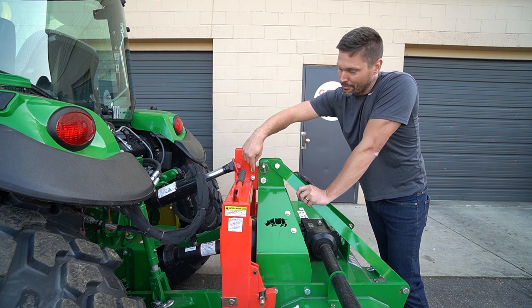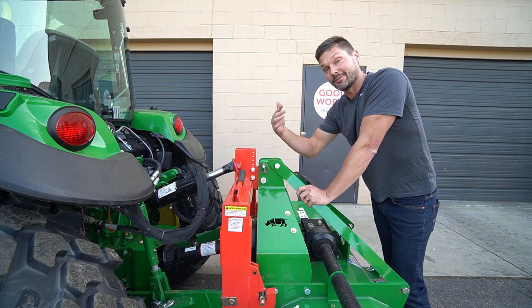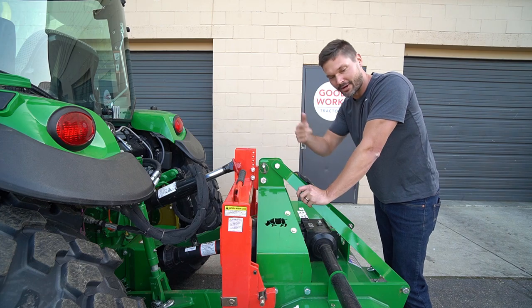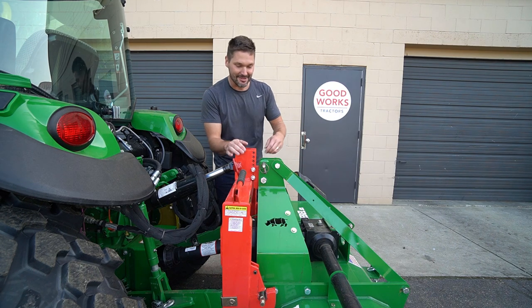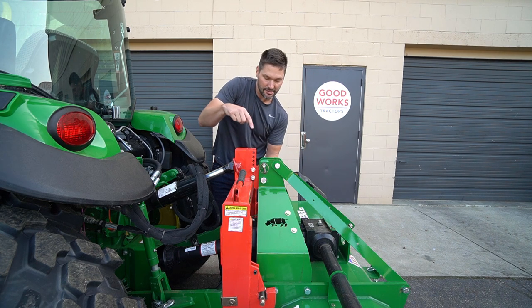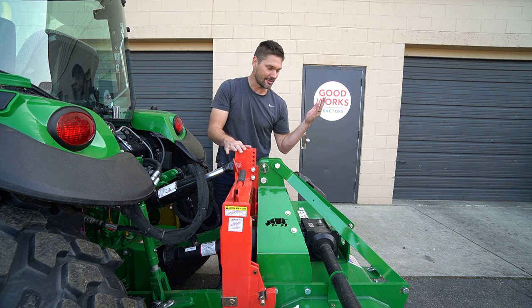The problem was that this bolt right here, I didn't have this nut tightened down, and it just rattled loose. Right as I turned around, I saw it falling out and disappearing somewhere underneath the tiller and getting tilled up. Now believe it or not, nothing happened. This bottom bolt was still snug right through here, and the bottom of this top hook kind of just pressed against the quick hitch frame here, and so everything just kind of continued on.